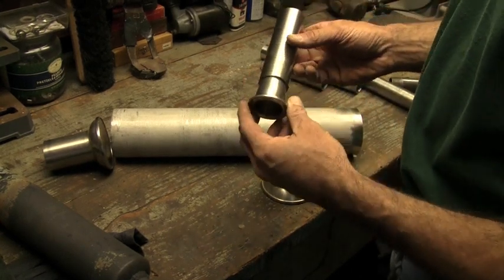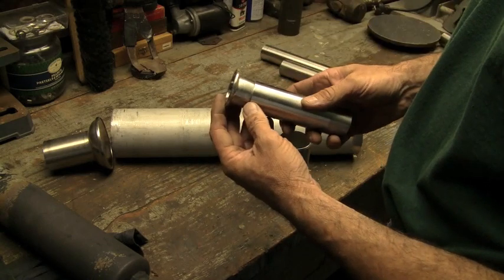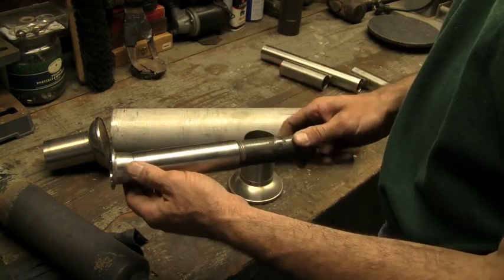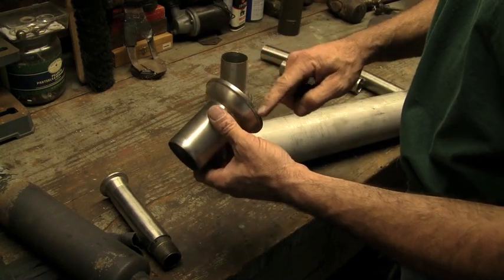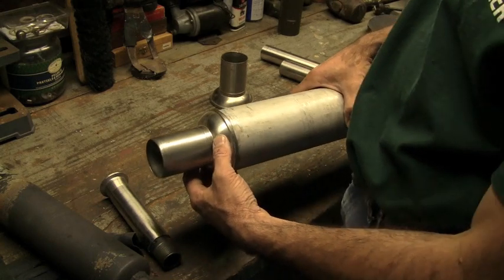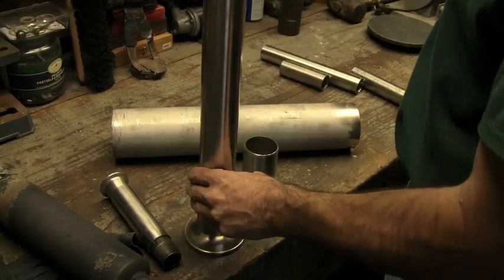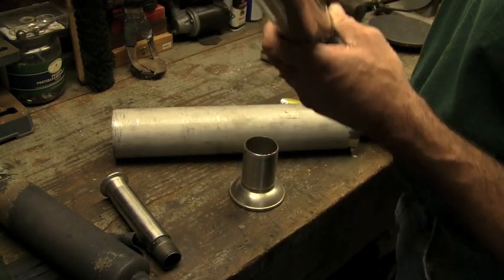This is a reducer, and here's my nip. The plan is to part this off and face it so this pipe fits right into there. This has a broad enough flange that I can position it right here. I'm going to put a stainless nip in there — it fits really snug. Then I plan to shape this edge on the lathe so it fits perfectly, with all my seams beautiful enough that I can fusion weld the whole thing together, ideally without filler rod. The inlet pipe is inch and three-quarters ID — big and throaty, which is what I'm going for.